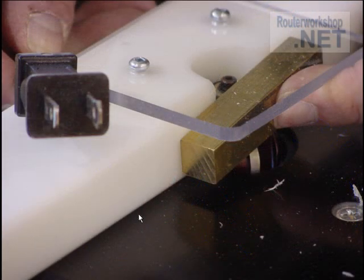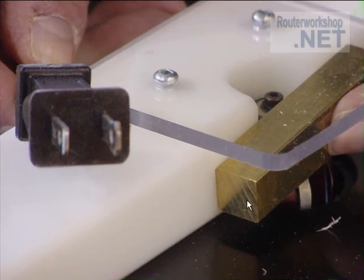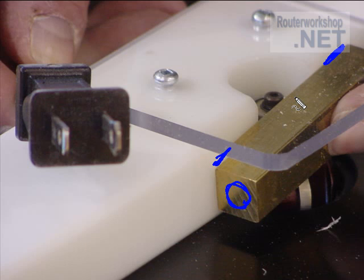All right, if you're cutting straight pieces, use a fence. And how to set the bearing up so that it matches the infeed and the outfeed of the fence is best done by putting either a block of wood, or in this case what I'm doing is using the brass bars. So the brass bar here on the outfeed, brass bar on the infeed matches, and pull the fence up till the bearing touches the same position as the infeed and the outfeed, and you're set. It's that easy. It's not hard to set it up. You don't need to use a bunch of measuring tools.